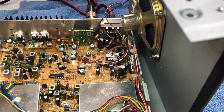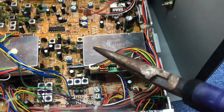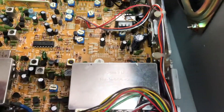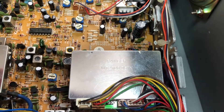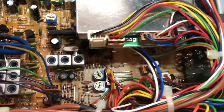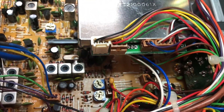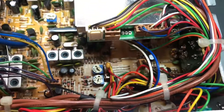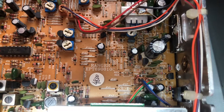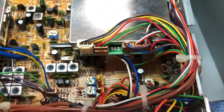If you don't have a high cut filter, it's a simple addition — just a capacitor between the ground and the wiper on the volume control. It has to be on the volume control side, and it just sends those high frequencies to ground. I'll go ahead and put this on the bottom side of the board here. On this board it's on J5 — this applies to boards like the 93T with the EPT 69010 Charlie board. Quick little tip for the high cut filter.